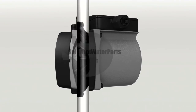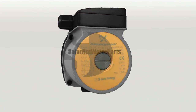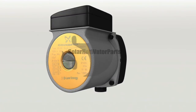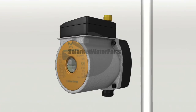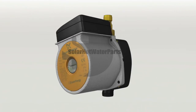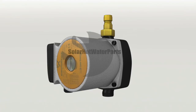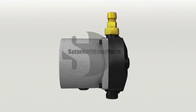The Grundfos 1520 SIL comes assembled and ready to install into the protective pump station cover. If the pump is not being installed into this style of pump station housing, the orientation of the motor will need to be changed. This can easily be changed once installed by undoing the four allen key bolts connecting the pump to the housing, then rotating the pump motor so the lead is facing towards the ground with the variable speed switch to the side and not facing up.